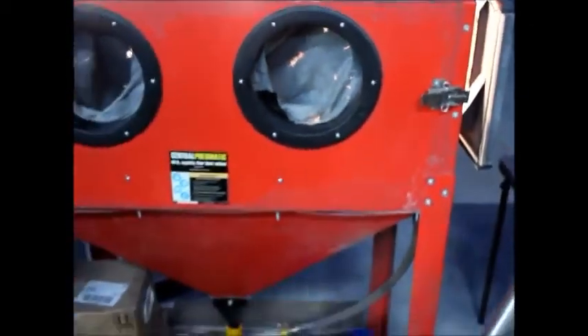You can see there's a vent here that comes with a kit that allows you to actually change how much air is coming out. So you turn your vac on, watch your gloves — as the gloves go out, you can adjust your air flow by that. There's also a different flashing on the side that keeps the sand from going straight out. If you're using your dust collector, use the back port — that one's where the vent is. Anyway, this is a Tacoma Blasting sandblast kit. I can't say enough good things about it. It completely transforms your Harbor Freight sandblaster into a really, really good working machine. Hope this helps somebody.